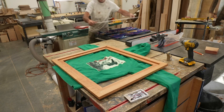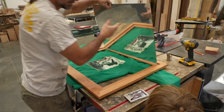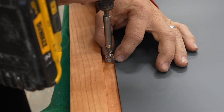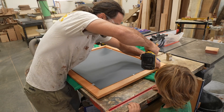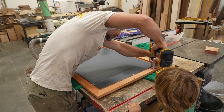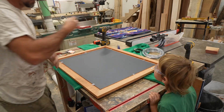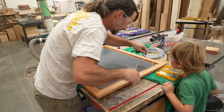For the actual mirror, I went to Lowe's — they will custom cut a mirror to any size you want. Each mirror itself costs twenty dollars, which isn't too bad. I used mirror clips from Lowe's to attach the mirror to the frame. I was careful to leave a little bit of a gap around each one so that if the wood expands and contracts, it won't crack the mirror. On the front side, when I clean it, I noticed it flexes and pushes the mirror in, so it would have been better to rip some strips of wood to attach the mirror instead of using clips — more traditional and a lot stronger. I attached picture hangers on each side and ran a piece of wire through them to hang it on the back.